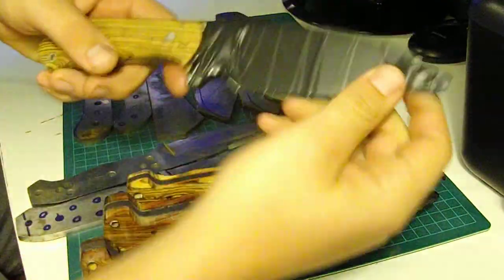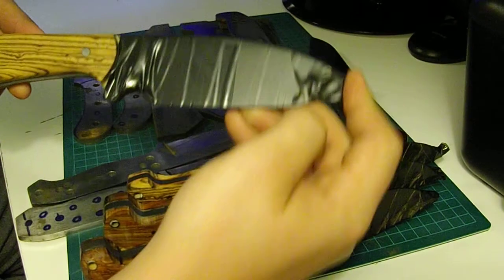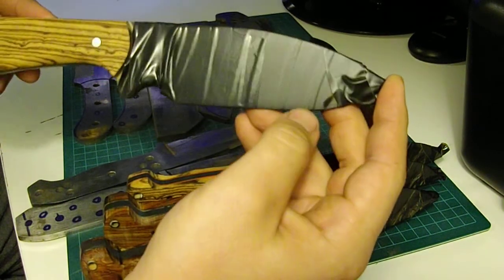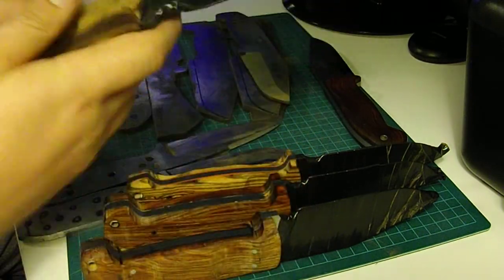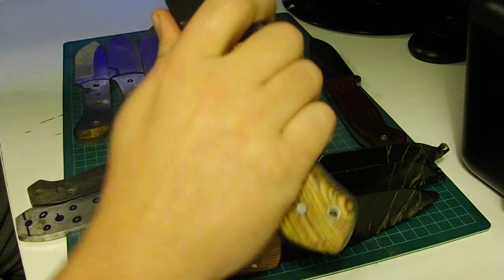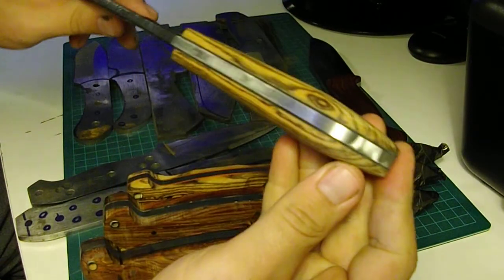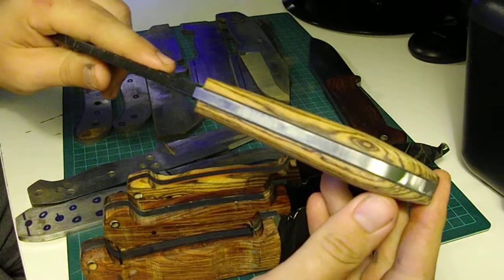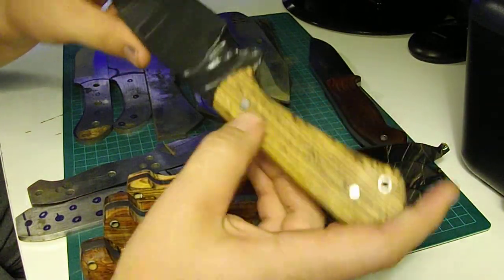Here's another style I've been working on — this is a spear point blade and it's taped up, so you can't really see what I've done with it, but it's a flat grind coming from about a quarter inch below the spine. It's got this finger choil in the front so you'll be able to choke up and do a forward grip on it, or hold back on it as well. I've started profiling the handle but still have a lot of work to do.